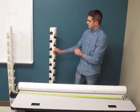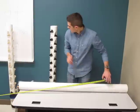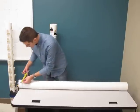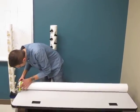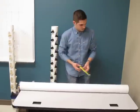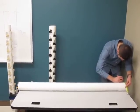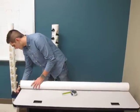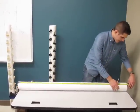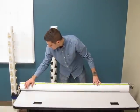Next, to line up the second set, we undo the clamp, rotate it just a bit, and then this is offset by four inches. So we'll measure four inches over on our pipe on both sides. Now we'll adjust the pipe so that it's even at the top, and we'll run the measuring tape across. Make sure it's nice and level and flat against your pipe.